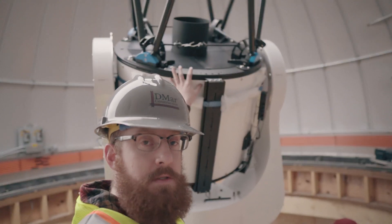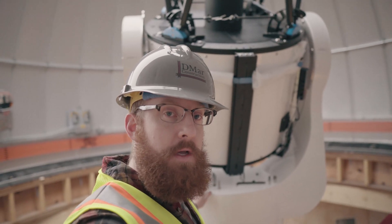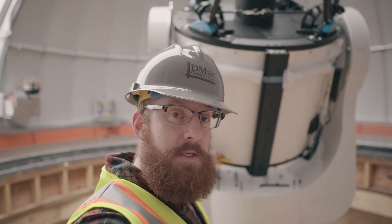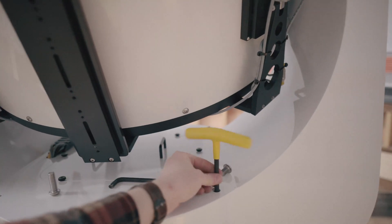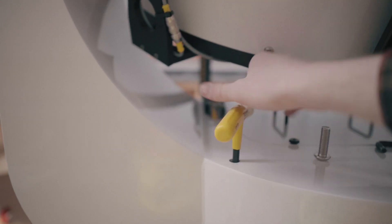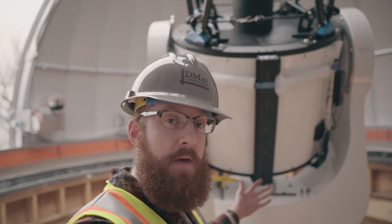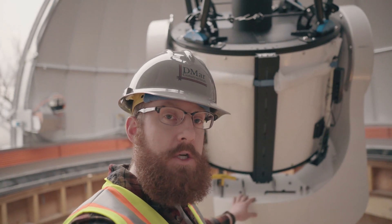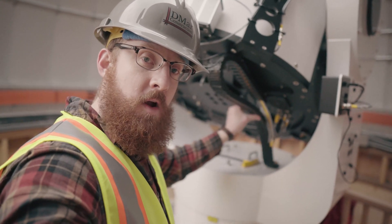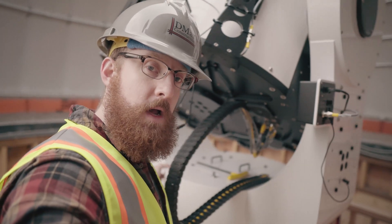The altitude axis has been tightened down with the bolts. Now we're going to go ahead and loosen the azimuth locking bolts. We took out the bolts covering up the holes, and with our T-handle — sometimes you have to seat it down a few times to find the bolt hole — we'll loosen all four. That frees up the azimuth locking system which prevents damage during shipment. Don't forget the one underneath the cable tray — that one hides. You can see the azimuth motor now rotates freely.